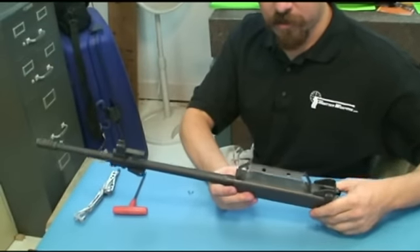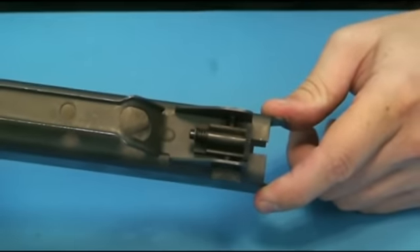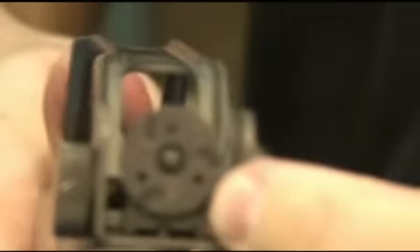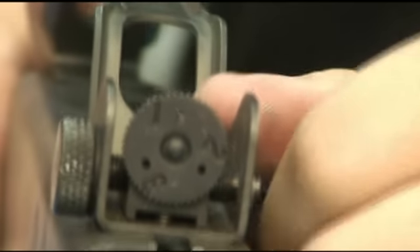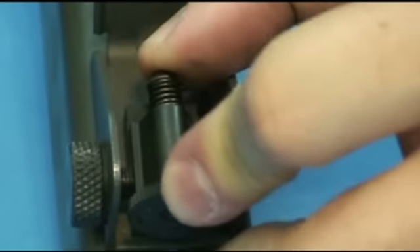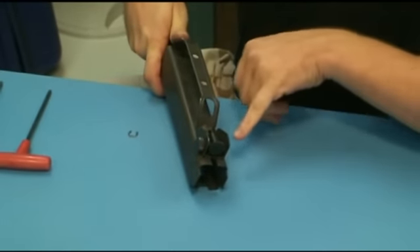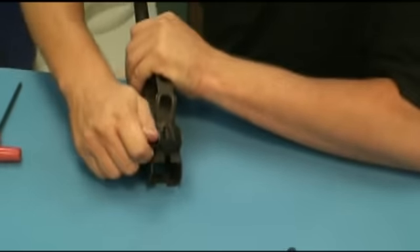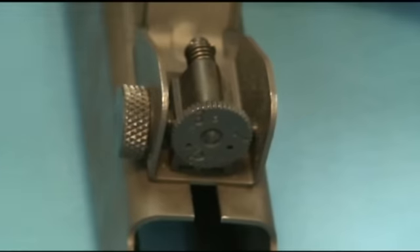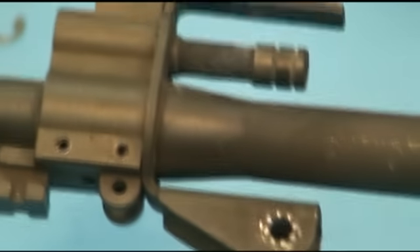Almost all the other components are of similar construction. The carry handle and rear sight base are a single component — started out flat, stamped into shape, and then bent accordingly. The rear sight on the Leader is round and has three different apertures set up for 1, 2, and 300 yards. To change the sight, you have to push in this spring-loaded piece and then rotate it to a new setting. That prevents you from accidentally rotating the sight partway or unintentionally changing apertures. The windage is a basic screw assembly on the side. Even the front sight retainer for the handguard is one stamped piece of sheet steel.